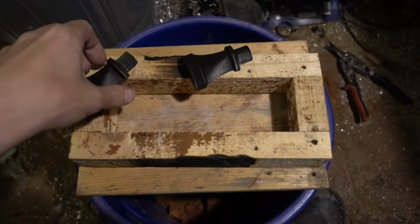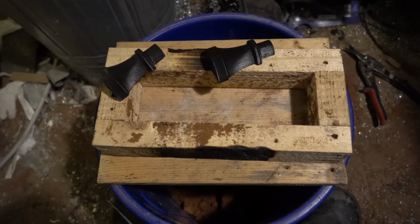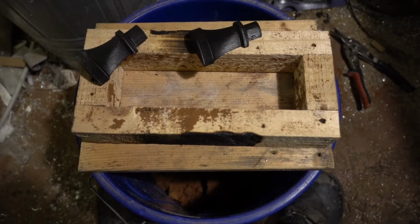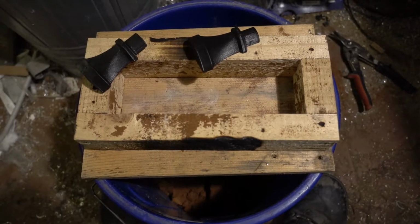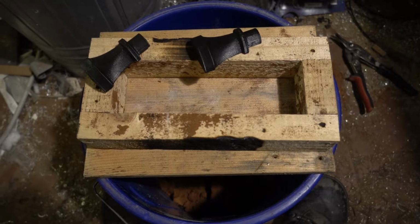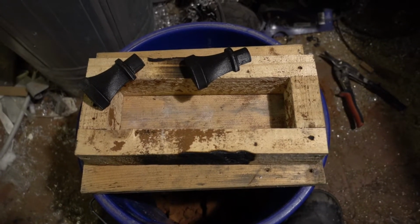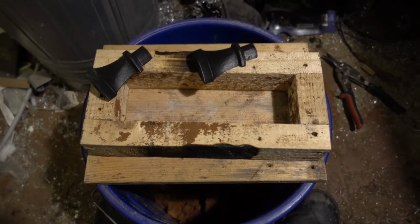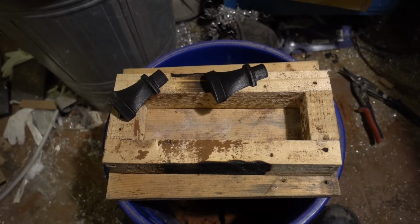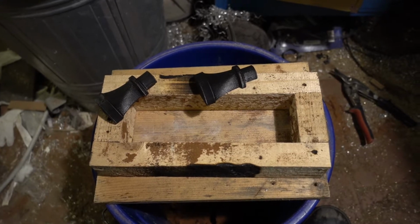Well, anyway, we'll weigh the material, and it will be 890 grams of copper and 110 grams of aluminium. I will not add anything more. Normally I would add some phosphorus, but I'm not sure about that with a plain aluminium bronze. I mean, the phosphides, I think aluminium phosphide isn't that healthy, but I have to look that up. You should really look up when you mix things to not produce some unhealthy stuff, or to at least know that you should not breathe the fumes or use it for food application or anything like that if you create some non-healthy stuff in the alloy.